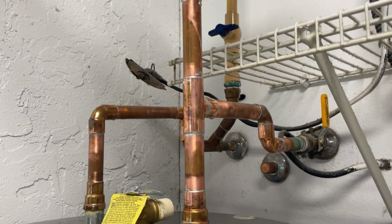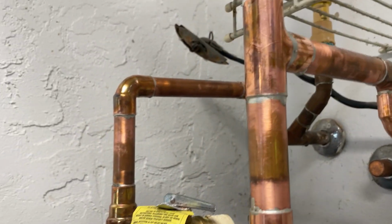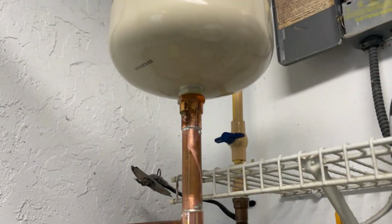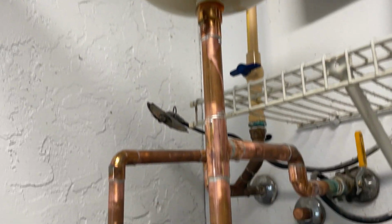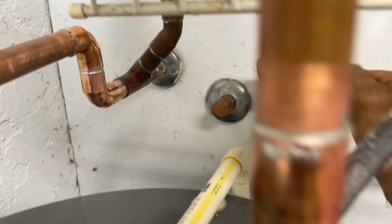There you have it. We cleared that shelf that was sitting in there. All our solder joints look good. Expansion tank, that is a proper way. It's an optional way to put these in. It's not upside down. Read the instructions if you have any questions. And the pressure release goes down into the pan. I have instructed the homeowner to open up a faucet on the hot side to bleed air out inside.